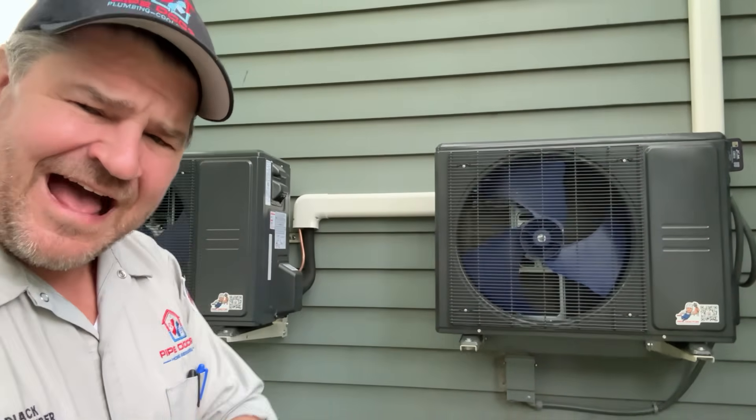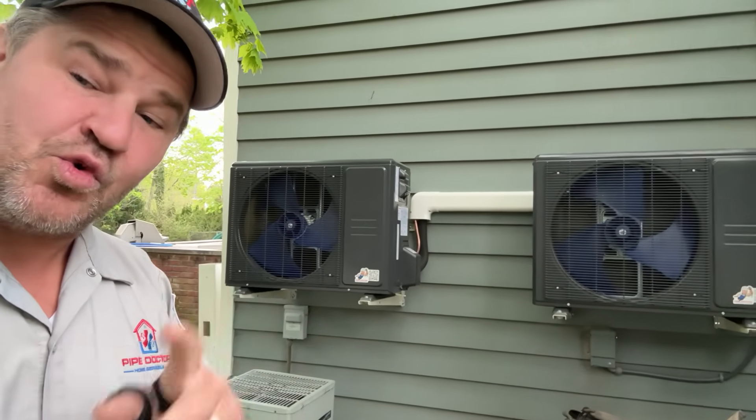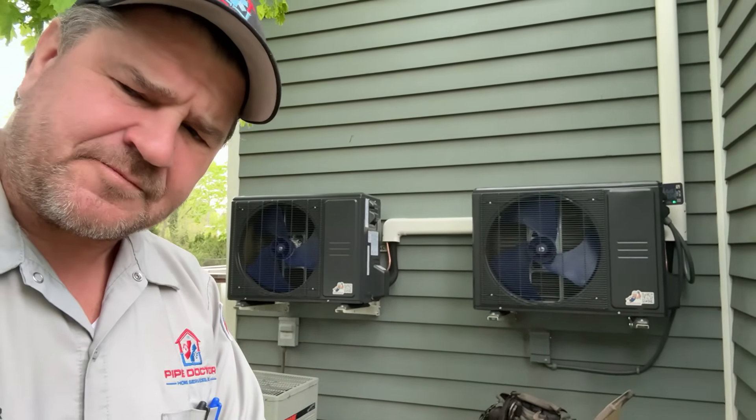In this final finale video, I'm going to show you step by step the installation of the Extreme Plus dual voltage 110/240 volt air handler, available in several different sizes to match your demands. I said dual voltage. There's no dip switches to play with, no interface cards to switch. It's just plug and play. You hook up L1, L2, and a ground, or L1, neutral, and ground — it automatically knows what voltage to work with, saving you time and money without the need for an electrician to convert from 110 to 240 volts. It's a win-win.